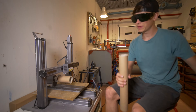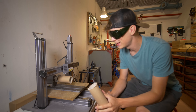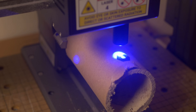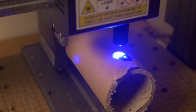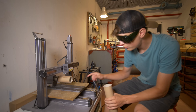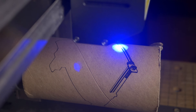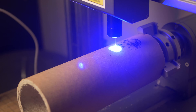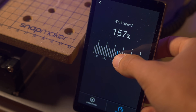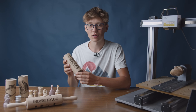If you've watched my previous videos, you may know that lasers terrify me quite a lot, so always wear safety glasses even if the laser is not working — it's really dangerous. I already went through the calibration process. You can see the calibration lines and choose the finest line to set the focus point of the laser — for that I used a cardboard tube. While the machine is working you can easily adjust the laser power and engraving speed on the touch screen, which is useful for finding the proper balance to burn something onto the material without burning too much.